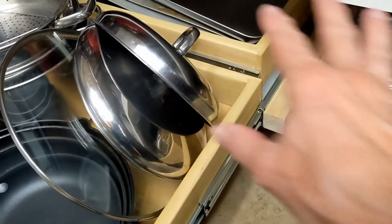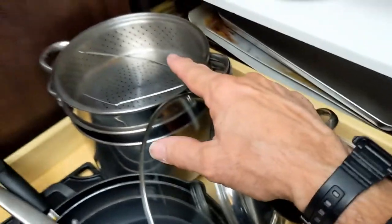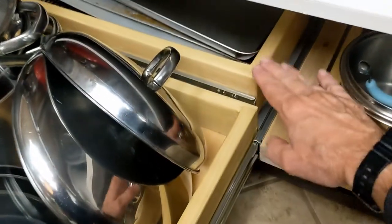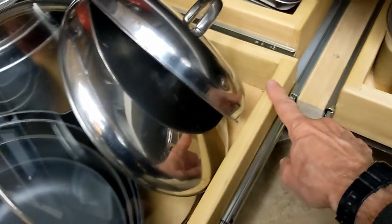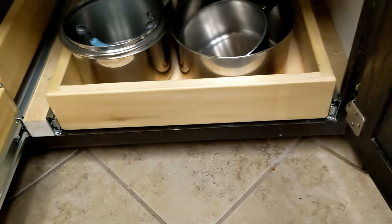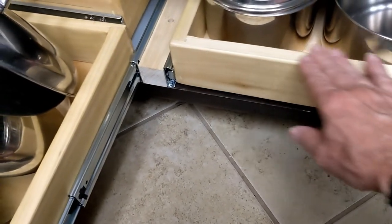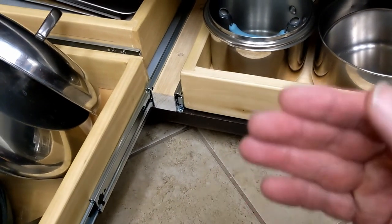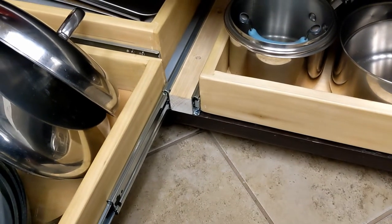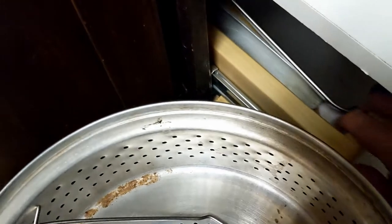You can also see that I chose to make three different trays, this one being raised by the size of the drawer slide so it'll go over the top, because there's obviously a drawer slide over there and it has to go over the top of those. This is a 2x2 poplar block, and the sides here are made of poplar as well. I chose poplar because it basically looks like a finished wood, and it's been treated with Danish Watco oil in the natural finish. It kind of darkens it just a hair, but it also makes it look a lot better and gives it kind of a glow, and it'll seal and protect. Let's slide this back and look at how these three sections pull forward, and when they go in, they completely go in.